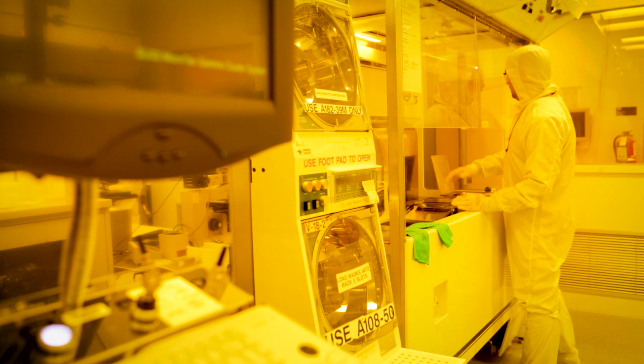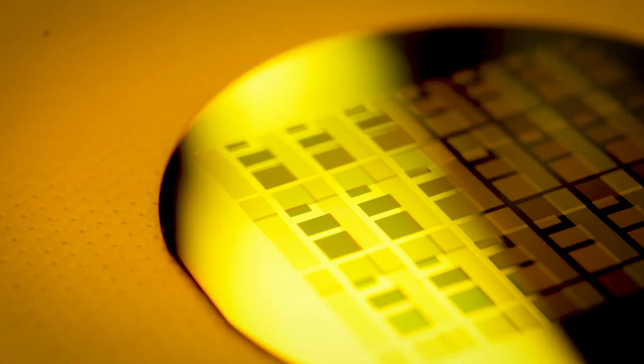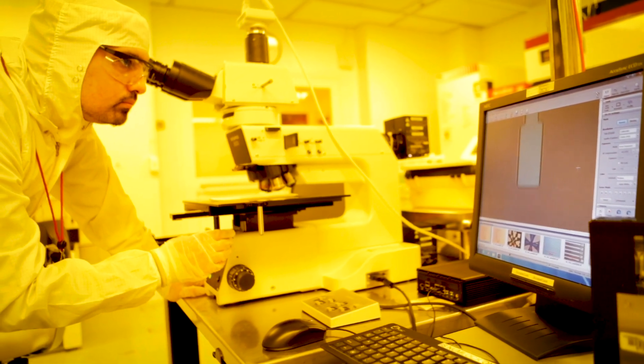What we do is fabricate the computer chips in 2D, and then within a couple of additional lithography layers we can put the legs or the swimming appendages on. We then release the object, it folds itself up into 3D, and then swims or walks away. The fact that we have in-house technology that allows us to build these micro-scale robots basically puts us ahead of the field, and the ability to manufacture things on campus in the nanofabrication facility is what's allowed us to really take this leadership position in this area.